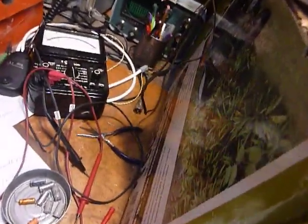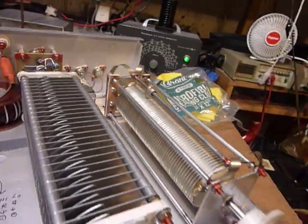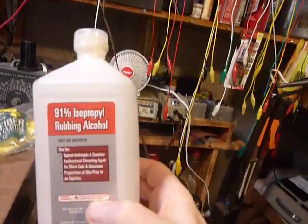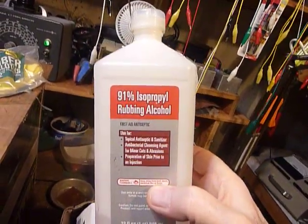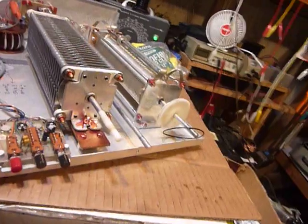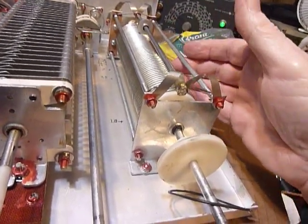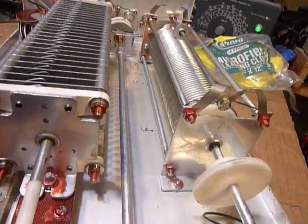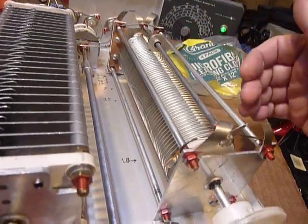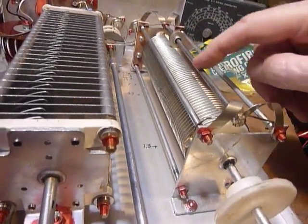For cleaning this inductor, I cleaned it with a microfiber cleaning cloth from the auto store and 91% isopropyl rubbing alcohol. You want to use the 91% instead of the 70% — the 70% will leave deposits on the coil. Also, don't put any kind of lubrication on the coil, because lubrication attracts dust and dirt. Once the roller runs over that dust and dirt when you transmit, you get arcing, and then you get little pits and spots in the coil.